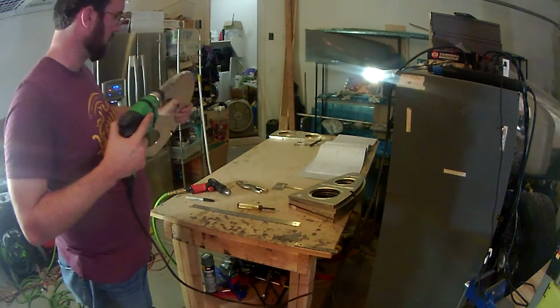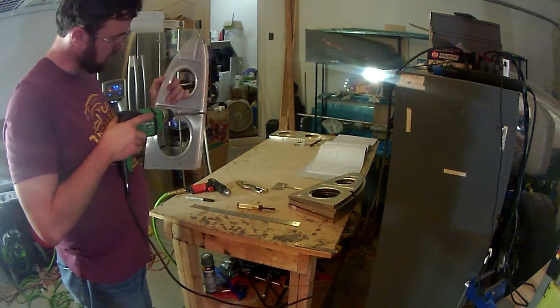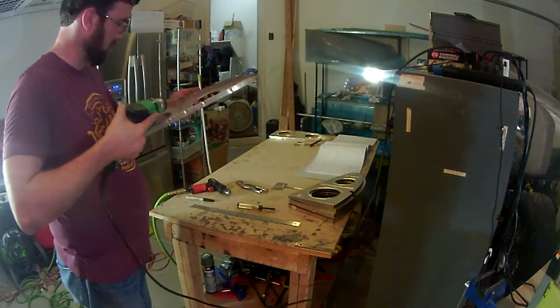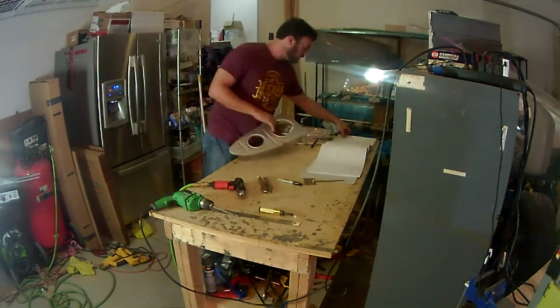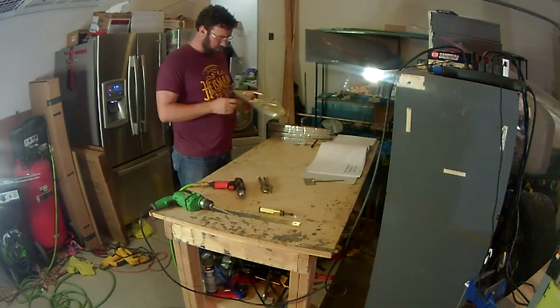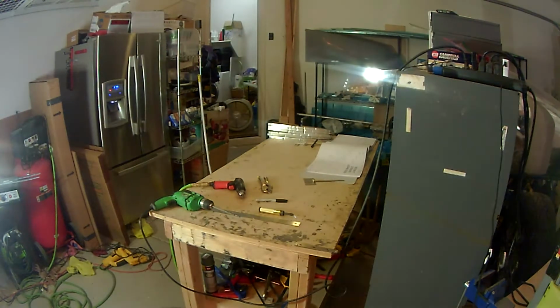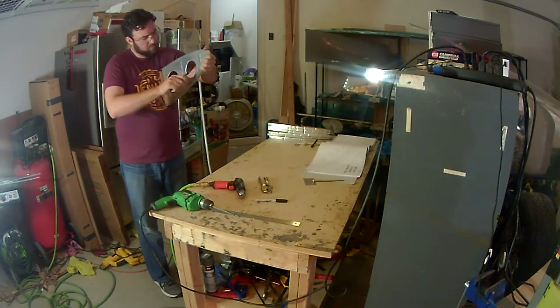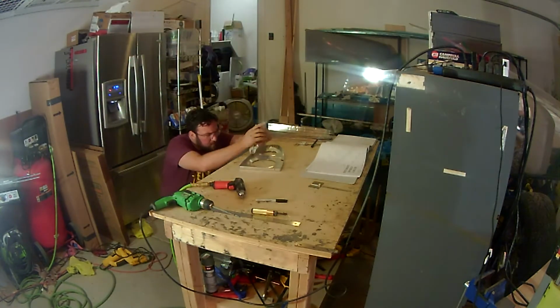And then deburring everything. Again, you want to make sure you're doing it. There's debate whether or not it's necessary on the 14 and the 12 because of the machine precision tooling and all that, but still a good idea to go ahead and deburr everything. I did fast forward through a lot of it because there is a lot of stuff to deburr. And as I'd mentioned in a previous video, I looked at a quick build kit, wings and fuselage, and based on those edges, I don't deburr enough.